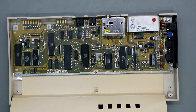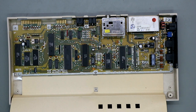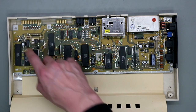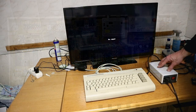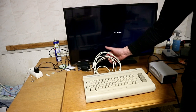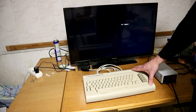And we have, like other machines, two CIA chips, the MOS 6526, one here. In this build, we have to change the electrolytic capacitors for the first time. This one here, here, here are some, here's one, and this. But before we do this, we make a little test to see if this machine works. So it's all hooked up. This is the power supply of the first episode of this series, and the video cable of the second part. I put the link in the description, and now we can test.